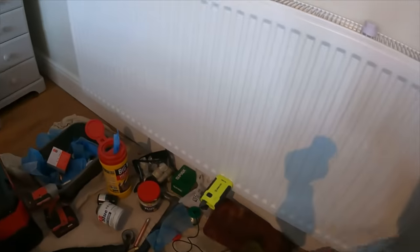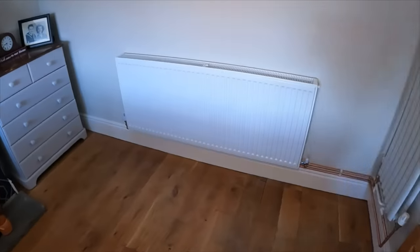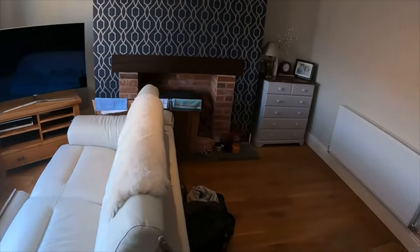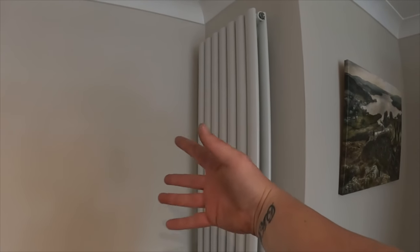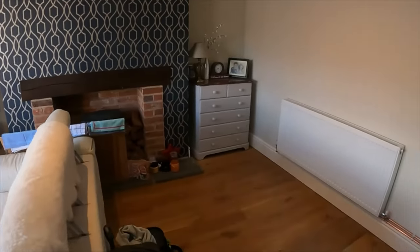We'll just get the air out of here now - valve's open, TRV's open, this one's full. We'll just pull the rest of the air out of the system here and then flick it on and get some heat into this. There we have it - rads all in, piped up, getting nice and hot now. You can literally feel the heat convecting out the top. The initial reason for this rad going in was the customer found this room was pretty cold with only the column rad - those panel and column rads just push heat out the front. Now with that double panel convector rad the heat is just going to convect all the way around the room - you can feel it already.